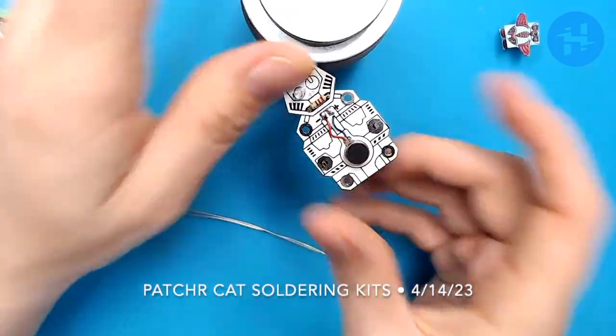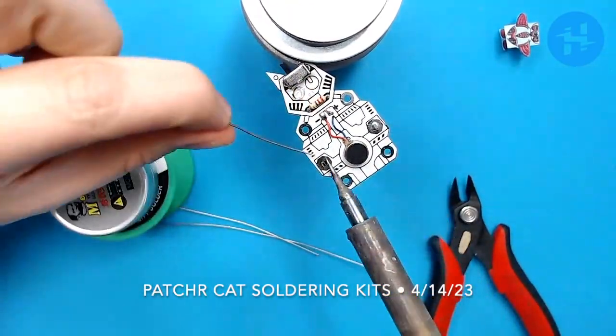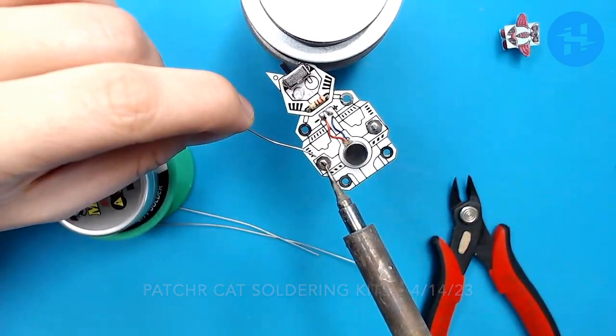The Omnivice is of course your minimal option, and it does look gorgeous. I like how you can easily spin this knurled top to open it up or close it down, and this little gear shifter is just cool. Where the Omnivice falls down a bit, in my opinion, is the lack of adjustable angle. I've actually attached little rubber feet to the bottom here to cant it forward so that I don't get reflections off of boards in my videos, and also the fact that this wide rounded jaw makes it difficult to clamp onto anything that doesn't have a reasonably flat, reasonably broad surface to attach to.